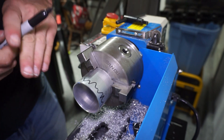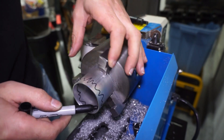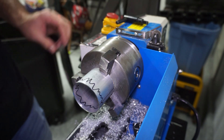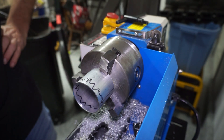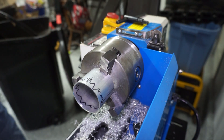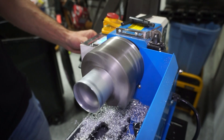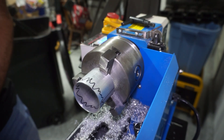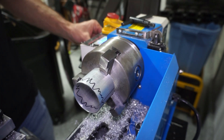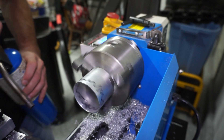The next thing I'm doing is marking this with a Sharpie inside and outside, then I'm going to hit it with a propane torch. This is called annealing — I'm basically just going to heat it up until the black Sharpie mark goes away. I've seen a couple of videos about this; I tried it and it worked pretty well. I'm going to turn the lathe on a low speed. You wouldn't need to use a lathe for this, but I'm using it because I have it and it's just a way to apply the heat evenly.